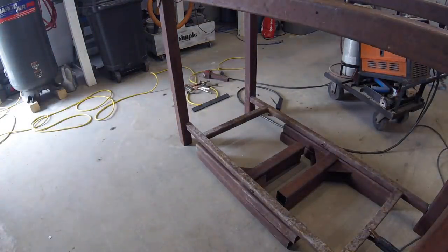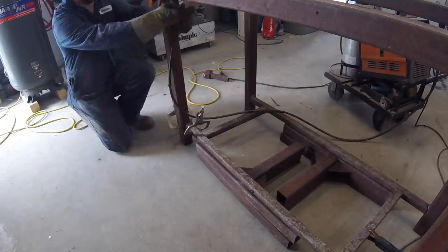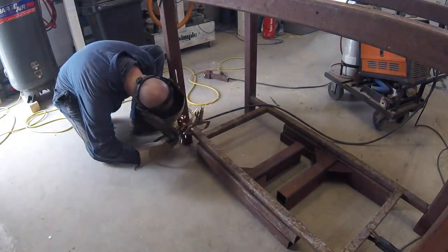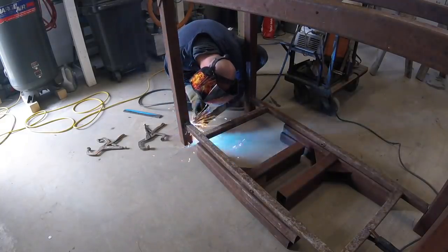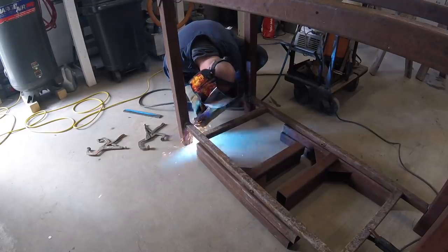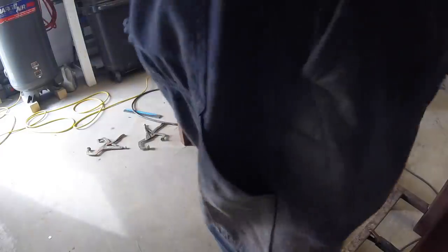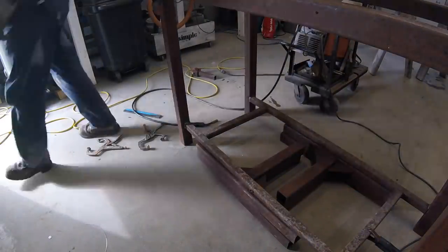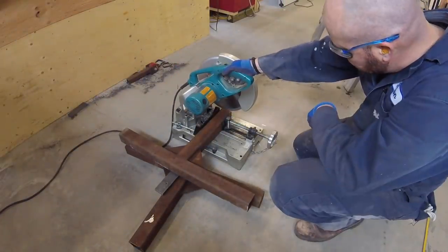I had to open up the doors to get some ventilation going. Also, when you're doing projects like this, it is definitely best to grind your areas around where you're going to be welding. I didn't on this project — I left the rust intact, literally just cut them and then welded them. I've got a good hot weld in there; I know it could be cleaner had I properly prepared the surfaces, but I wanted to keep that rusted look and didn't want it disrupted at the joint.